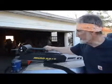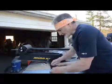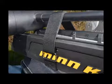I've got my holes drilled, but we're not finished yet. This hold-down strap came with the motor and it's very important — it holds the front of the motor and keeps that big motor from bouncing around when you're in rough water. You want the end of the latch sticking out, so I drill holes through it so it doesn't move. I take a nail and pop it right through where the holes are to get them started. When we bolt the motor down, the strap will be bolted down too so it won't go anywhere.